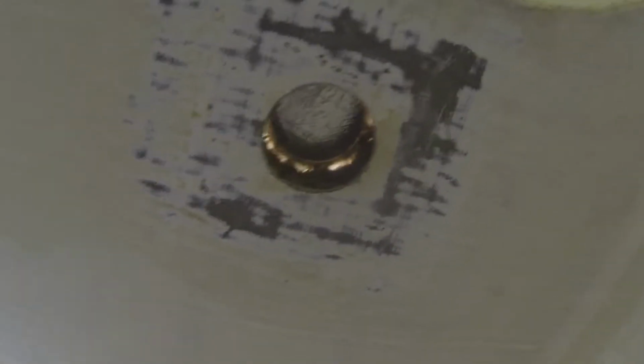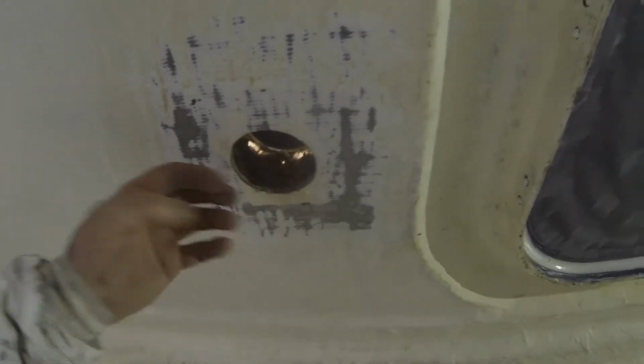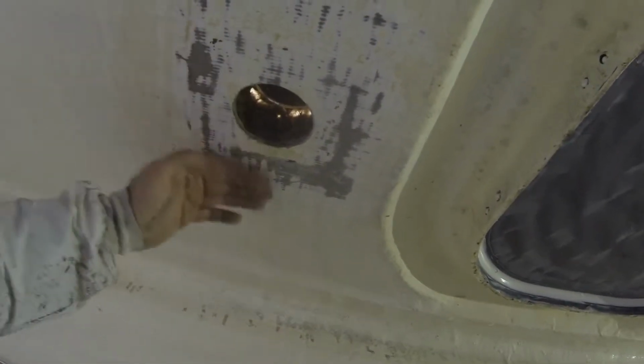And then this is the underside of our little old vent. So you can see the silver paper there. It's going to create a stop, and then I'm just going to glass up in there, make that good. I've dug out some of this core, as you can see, so I've got a scallop in there. So when I glass in, it's like a fat donut effect either side of these skins, and then there'll be a nice clean pad straight over that, and then that'll all be flow coated neat and tidy.